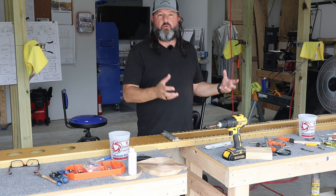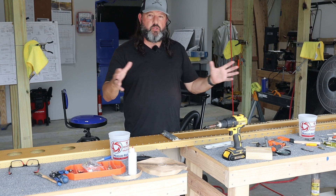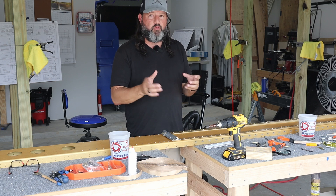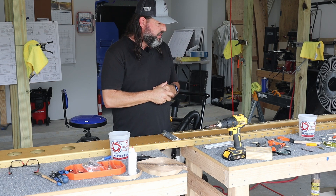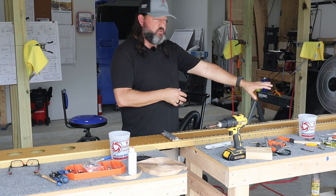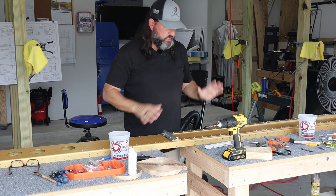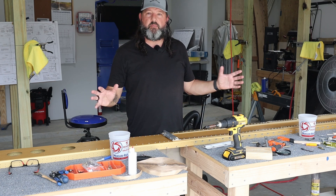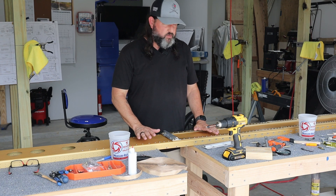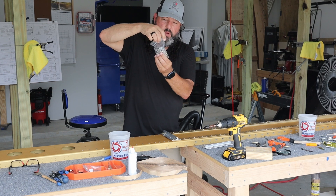When I inventoried this kit there were so many extra small parts — completely new, different size rivets, different size bolts, thousands of nut plates. A lot of that stuff lived in its bags and I'm paying for it now, because when I get to a part in the instructions it tells me to find, say, AN 426 3-7, and I have to scan all eight pages of the inventory list to find that part number and which bag it's in. I'm going to have to expand my collection of small parts bins. I was warned about this — a lot of people say they wasted so much time in later construction just fishing parts out of mixed bags.